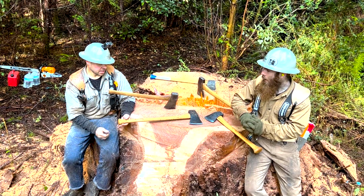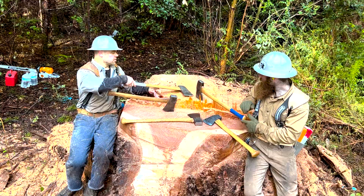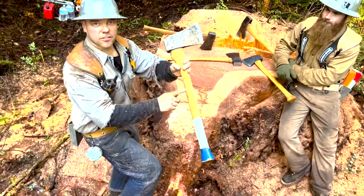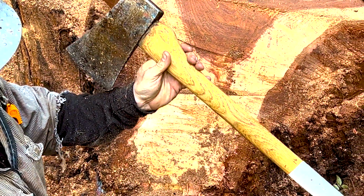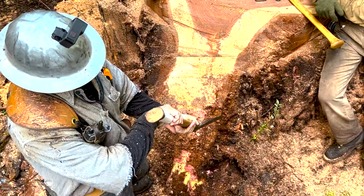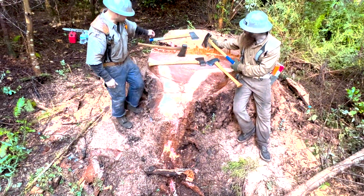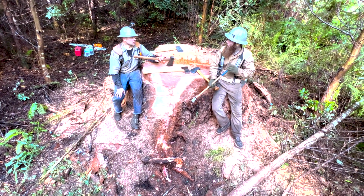Grain orientation. Yeah. Everybody wants perfectly straight grain and stuff, but we should talk about that. Here's one that Anton, you probably had this axe going on 3 years, right? Yes. It's got a knot right in the middle of it on a 5-pound Stroh, and it's never broke. I mean, look at it. It's ugly, but it swings good, and it's been a great handle. You've been whacking on this thing, and the grain orientation is good, but it has a big limb right in the middle of it. It still hasn't broke. So sometimes you get one that's like, oh, that thing's ugly or whatever. Like Garrett usually takes the ugly ones and he can't break them.